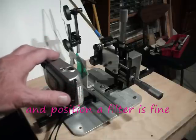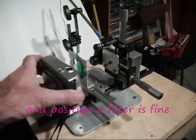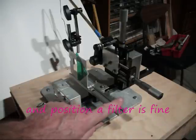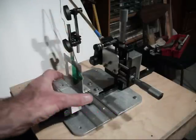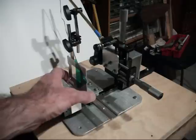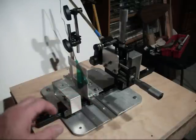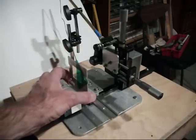This isn't the camera that I use for the photography — the camera I use is actually the one I'm filming with right now. But the camera would sit here and I can position the camera back and forth. In front of the camera there's this filter on a little window, and this is on a slide as well, so it can slide back and forth. I can use that as the Schlieren stop, so that the light refracts because of the temperature or density gradients. Some of it goes through the green side, some doesn't — that adds the color.